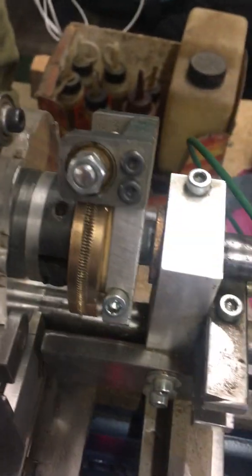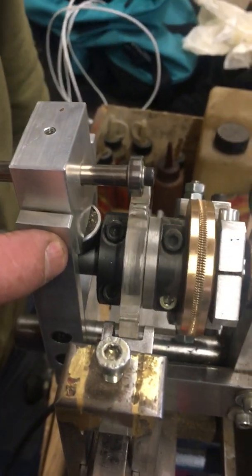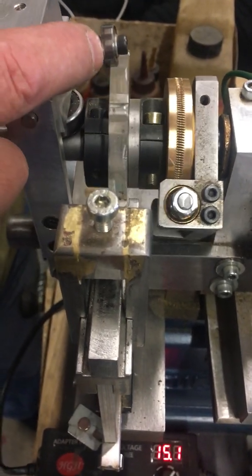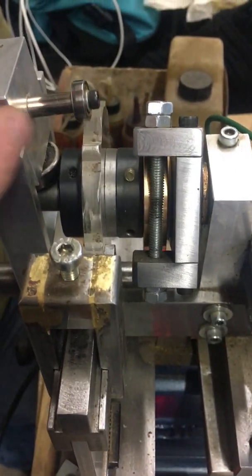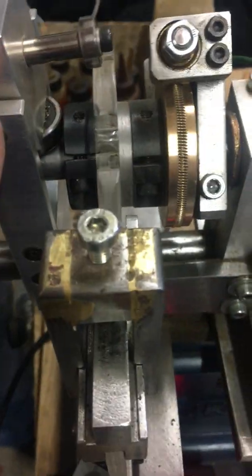What we're doing here is the fulcrum of the pumping rubber. The pumping rubber takes the movement from the rosette here, with this ball bearing, and we have a first lever which can be adjusted when you want to change the length from here to here.